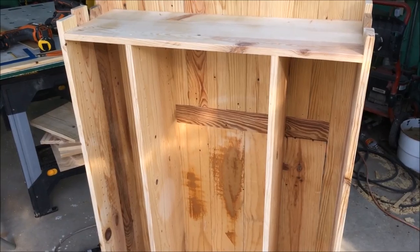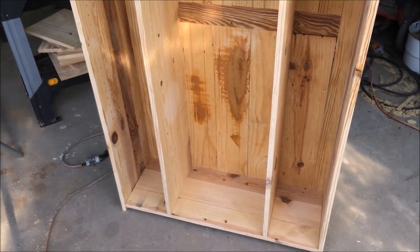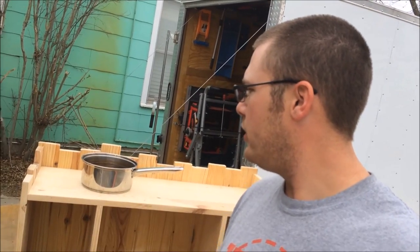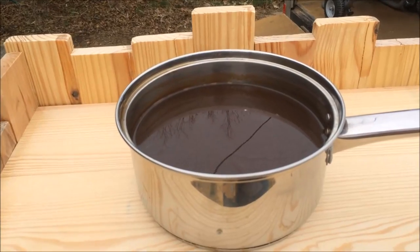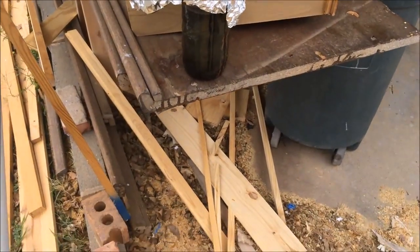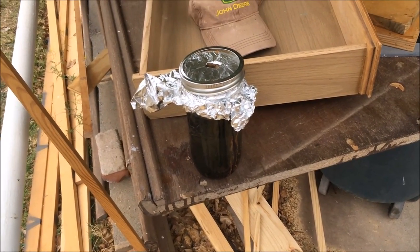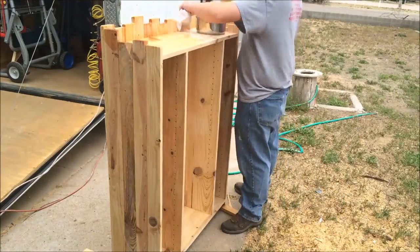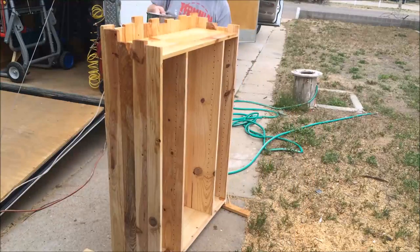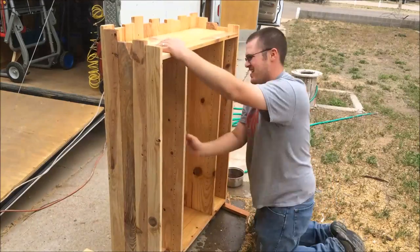Sanding, finishing. I'm letting the steel wool and vinegar solution sit out in the sun, and I'm going to put the wood out in the sun to let it get a little sun-tanned and even put tea on it. According to the internet, to get pine aged to look like old weathered wood, you boil up really strong tea, and then you mix steel wool and vinegar and let it sit. You can see it bubbling — I had it sealed and then poked a hole in it because nothing was happening, and now it seems like it's oxidizing nicely. The theory with the tea is it adds tannins to the wood that gives the vinegar and steel wool mixture something to react to, because pine doesn't naturally have a lot of tannins. I have no idea if that's true, but the results worked.